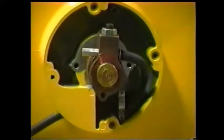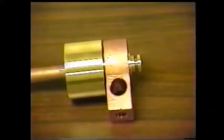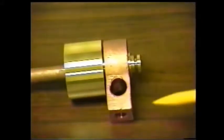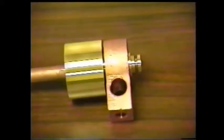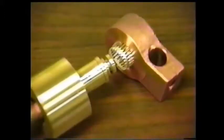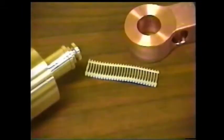The connection between the movable portions of the reel and the stationary ground bar can be checked inside the reel. The contacts are factory sealed by the cap shown on the right in this view. The slip ring has been removed from the reel; the normal cable termination would be in the 5/8-inch hole. When installed in a reel, the tamper-proof cap would be on the end of this rod. The slip ring has been partially disassembled to allow viewing of the actual construction of the contact. The contact itself is a spring-tempered copper bearing alloy that has been silver plated, with multiple contact points to improve current flow.